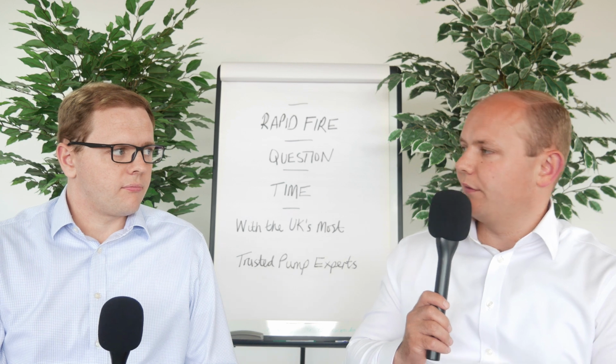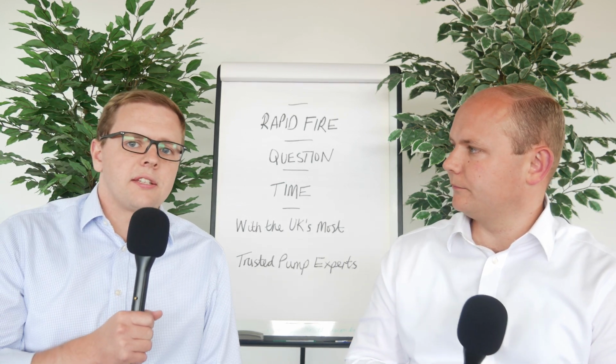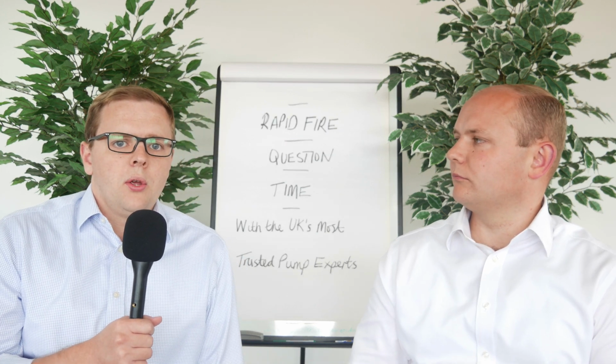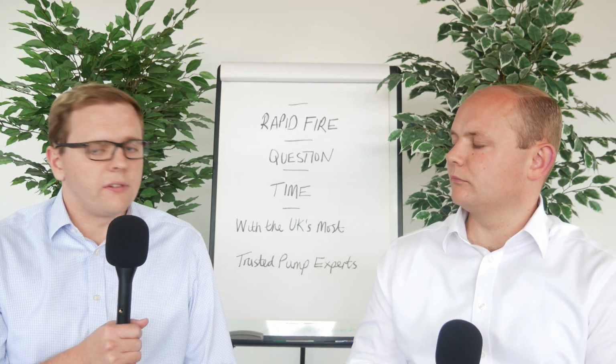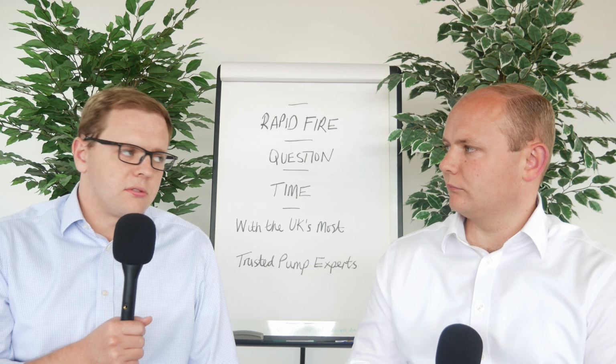Okay, so in summary, yes, there is a minimum radius bend required, and you say it's either 20 or 25 times the overall diameter of the rising main. Yes, that is correct. Other considerations also include, when laying the rising main, that the bend is not too near any joints. So if it's being fusion welded, for example, that the bend is a good distance away from a joint to ensure that the joint doesn't fail.